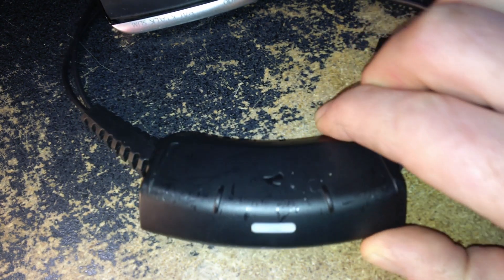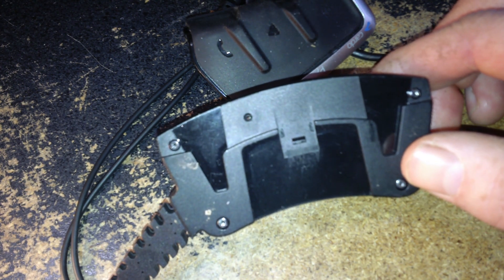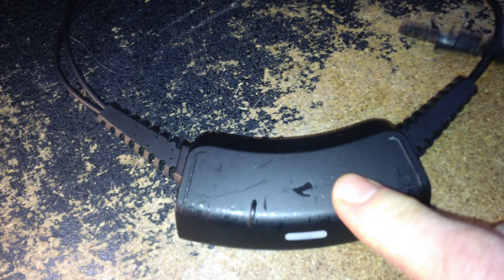These are the buttons that sit inside your helmet, and this is the battery pack unit. To replace a battery, there are four screws on it — you can see the screws. The back pops off and there's a little gasket there. You do have to do some soldering to get the battery out, but it doesn't look terrible. You can get a 1S or 2S lithium polymer lipo battery off eBay if you need to replace it, which is one of the common things you need to do on this.